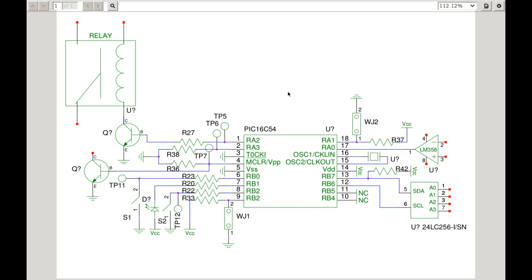So what I did is recreate part of the schematic to understand how it works. The central microcontroller is a PIC16C54 — an EEPROM-based, very cheap, one-time programmable chip. It controls two relays and has only one switch on the MDR version. The MDR2 has two relays and two switches. The board is exactly the same and the software is exactly the same — the difference is just the price and that more components are populated. We also have a connection to the LED.